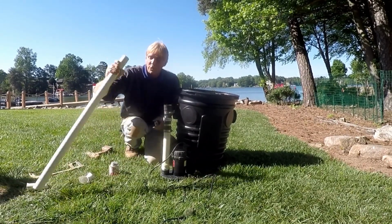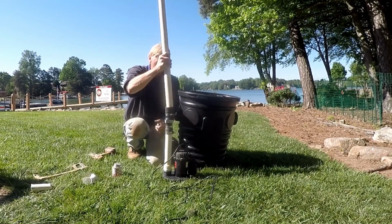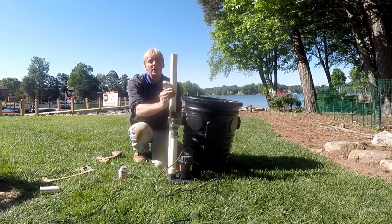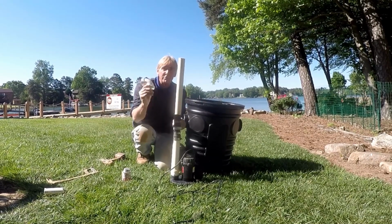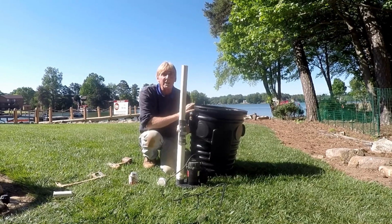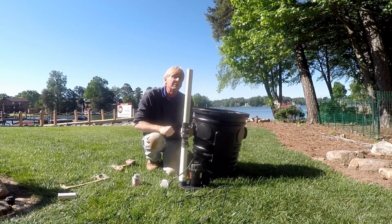So now we're ready to go down and put this pit into the crawl space. Remember that it's going to have a riser that comes up, out, and at the top of that riser we're going to put a 90 on it and come through the foundation wall. We'll make those measurements once we put the pit in place so we can get a perfect fit.